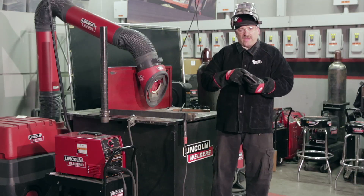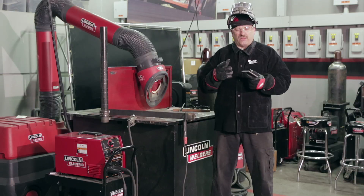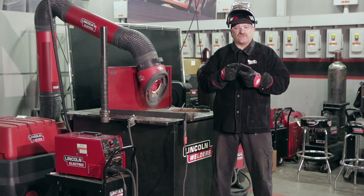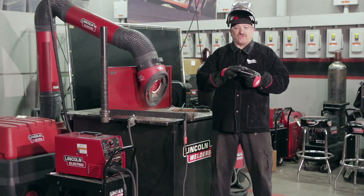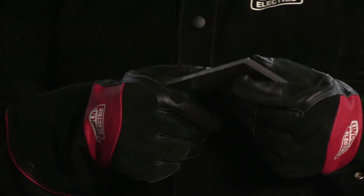Fit-up is real important. Today we're going to be taking this test with a 3/8 thick plate, and that covers you up to 3/4 of an inch material thickness on full penetration welds. On T-joints and lap joints, it would cover you on limited thickness. A lot of contractors test on a 3/8 plate — it's more economical. Some contractors or construction trades have to go to a one inch plate, but for today we're going to use a 3/8 plate for this test.